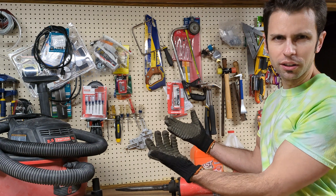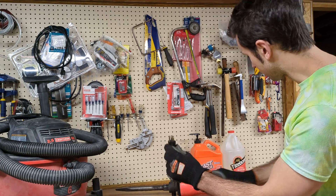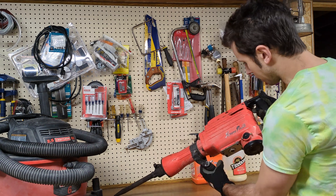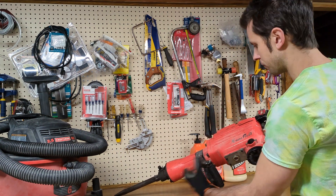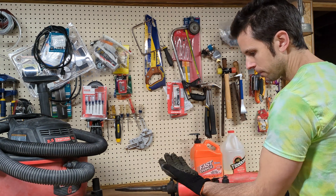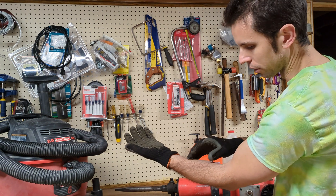Next, with the jackhammer, I'm always wearing anti-vibration gloves — a lot of insulation. Even though the cable on this one is grounded and everything is metal, you've got plastic handles both here and here. With insulated gloves plus the fast motion of this tool along with tons of swirling concrete dust, my hands might be well insulated from getting static shock there, but the static shock I was getting was up my uncovered arms.